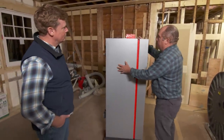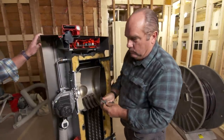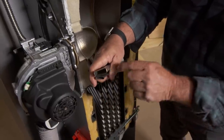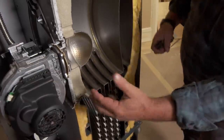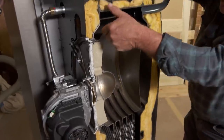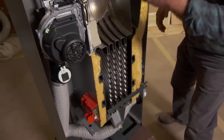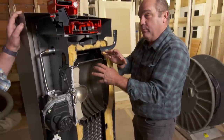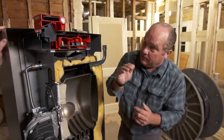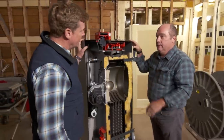So this is a cutaway of this larger water content boiler. When these wall-hung boilers first came out, the heat exchangers had relatively small water content — this was one and this was another, stacked together with the flame coming through. That's the full volume of water you had. But with this, you can see a burner right here. The burner comes on with this beautiful flame that will just modulate and change according to how cold it is outside. And this is how much water content — water everywhere. So now that water is gently circulating out through the building. It'll take the burner's input and just stay on. It seems backwards — you're going to leave the burner on, but at the perfectly lowest amount versus having it come on and off. Also counterintuitive: in this case, bigger is better than smaller. We want to reduce cycling because we're inefficient when we're cycling.